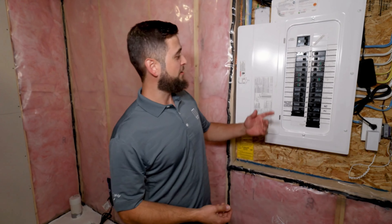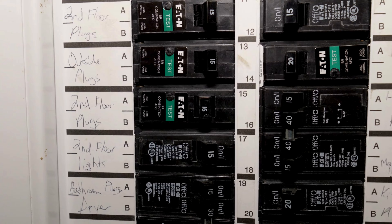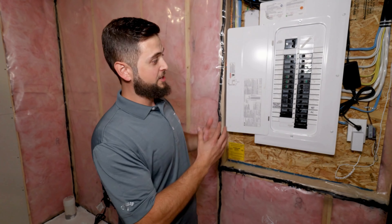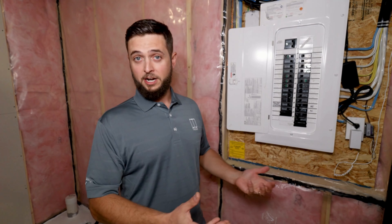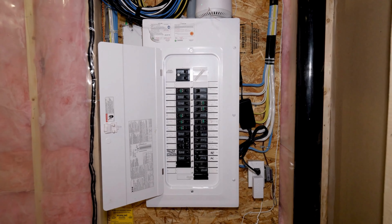The special circuits to be aware of in your breaker panel are the arc fault circuit interrupters. They're indicated by this little test button here. These are very sensitive circuits. The intention of it is to mitigate any fire hazard. So brushed electric motors, i.e. an old vacuum cleaner, can actually trip these breakers.